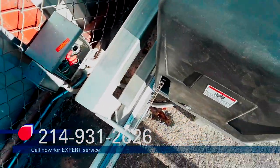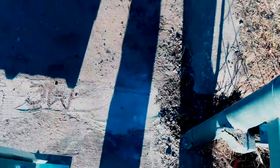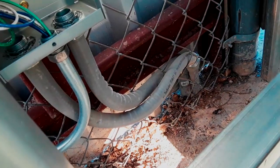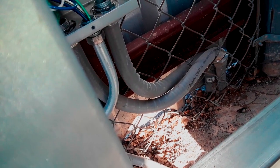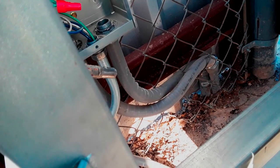One of the things I have to do is run the wire from the gate operator over to the receive head of the photo eye, which is going to be mounted right here. There's a conduit that has been pre-installed underneath the driveway, coming out right there. They attempted to tape off the conduit at the end so no dirt would get in it. That's going to be a really tough pull — you've got a 90 and then going into another 90 right off the bat.